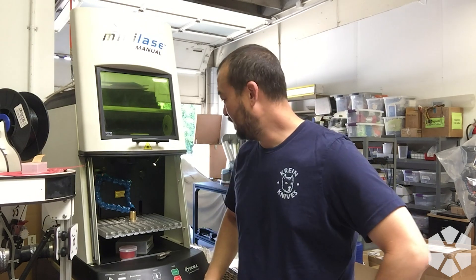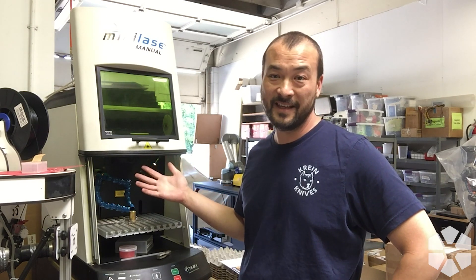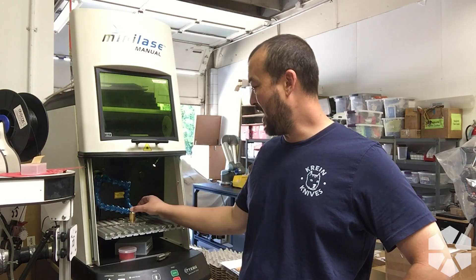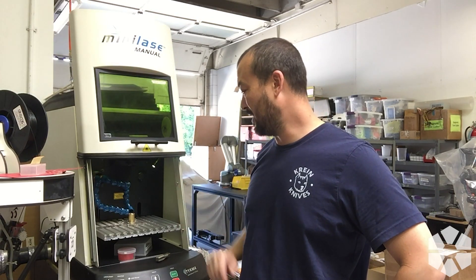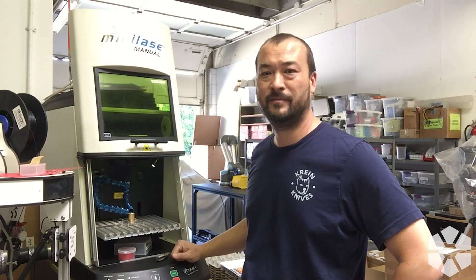That's pretty sweet. I think it'll work. The main goal was to remove the particulate matter due to the lasering process at the point of origin, right where the part is being cut, rather than evacuating the entire area through a little hole up here. That's also going to keep the inside of the machine cleaner, which means less maintenance. And if it really does exhaust enough particulate, we can run this thing lights out at night — robot going all night long making parts. That's the dream, baby.